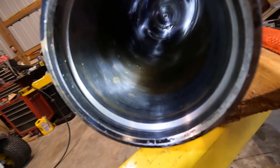I've got some pitting in my bore of my cylinder right there, and I've sanded it the best I can. There ain't much I can do about that. Hopefully it won't leak. The seals are really bad and falling apart, so maybe that was all the problem was for the most part, but that cylinder does have some pitting there.